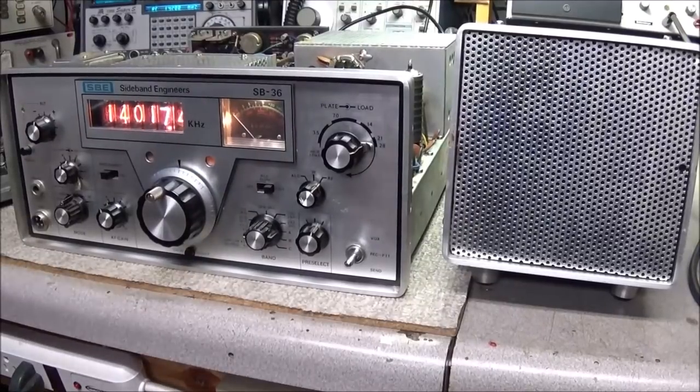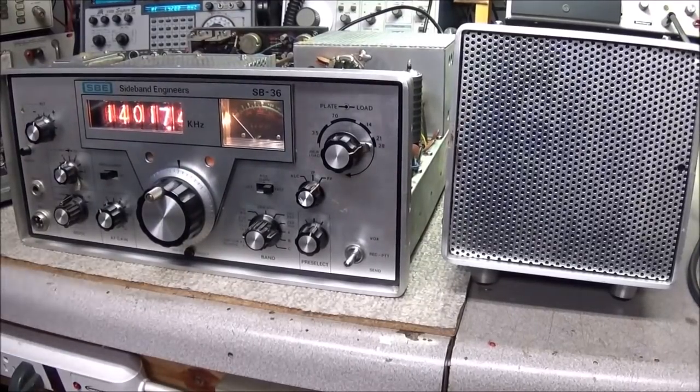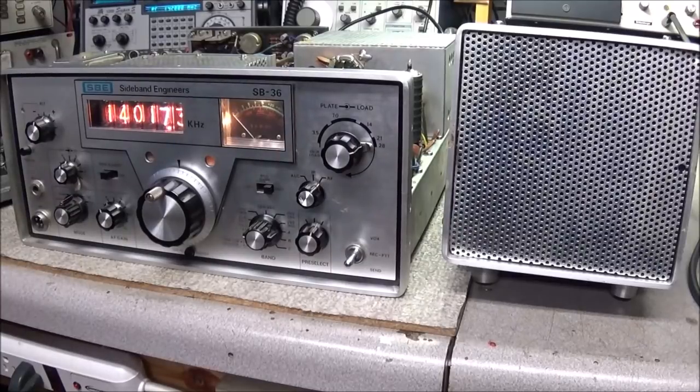Okay, enough of that ranting anyway. So next video, when we get a chance to shoot some more video on this, we'll be going through and doing a lot of voltage checks and making sure that everything is within line. I did a preliminary voltage check first just to make sure all the voltages were present. One of the other problems I had was the negative 9-volt rail, but it's at around minus 7 volts or so. So we've got to look at that and find out what's going on with it.